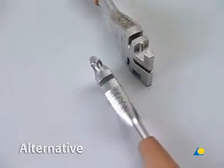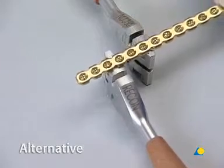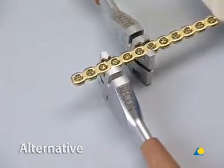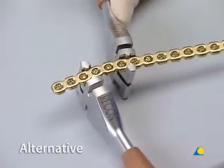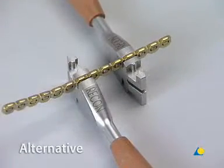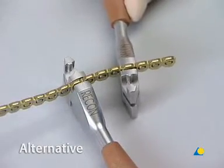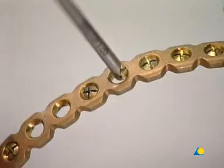As an alternative, the first two steps can be done with the bending irons. For in-plane contouring, the corresponding openings are used, with the bending irons best positioned opposite each other. Bending out of plane is carried out using the appropriate openings. After bending is finished, the bending screws are removed.